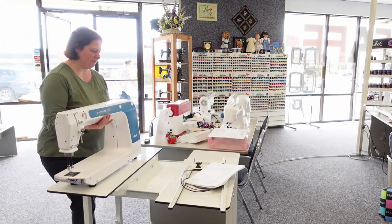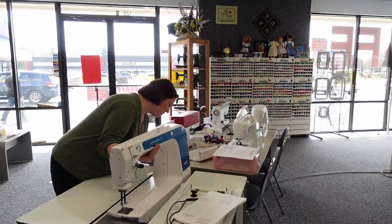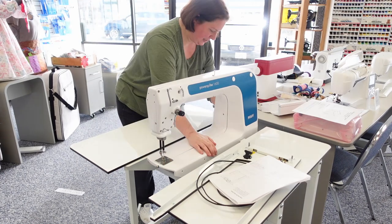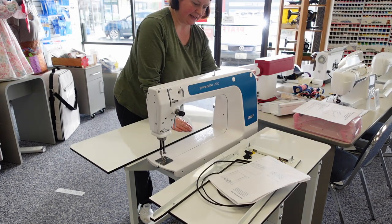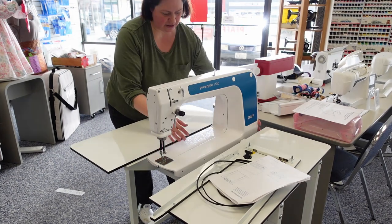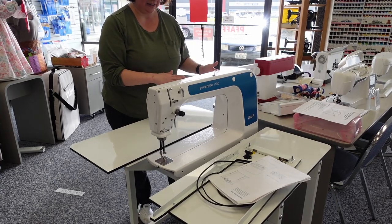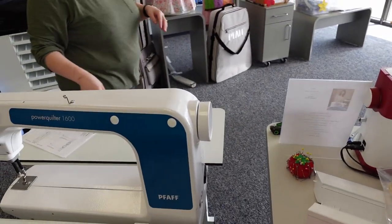So we just had to put this platform to its highest point and make sure we anchor it pretty tight at all four corners. Then we are going to take the machine and make sure all four of the rubber feet of the machine are sitting on the actual platform — sitting centered this way — and the hand wheel itself way back here will just be inside the table. So all four rubber legs on there; you have these flanges here that will allow you to bring the machine in, and that's where the stitch regulator table is going to lock in.